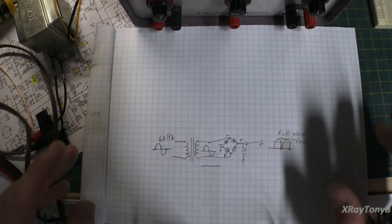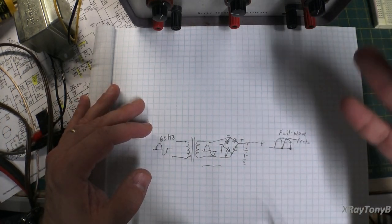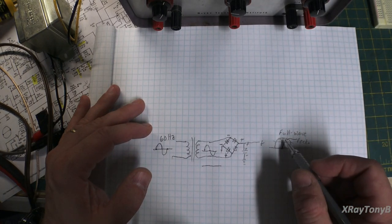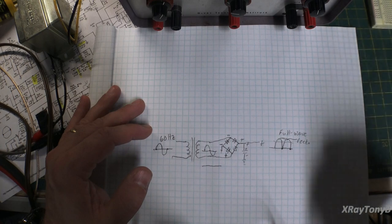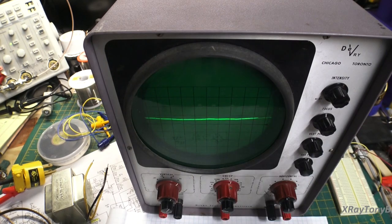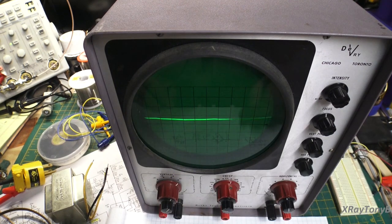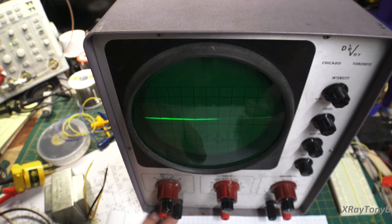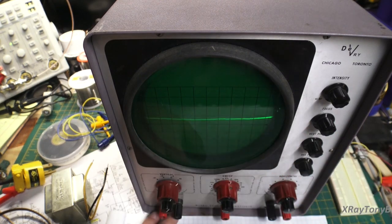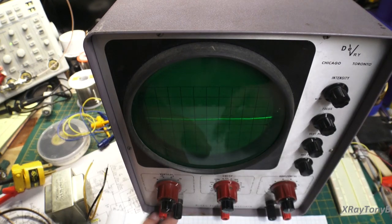I understand that, guys. All you electrical engineers out there will say, well, dummy, just put it on AC. Well, we're trying to prove a point here of the scope. So your DC meter will not read correctly. But when we hook an oscilloscope up to that signal, even though this thing couldn't tell me how many volts and couldn't tell me how many hertz, it did tell me that I did not have a DC signal on there, and it did show me what the signal did look like. Okay, that's why this scope was such a revolution. You know, before an oscilloscope, there was no visual method of seeing what the signal was doing. You couldn't tell.